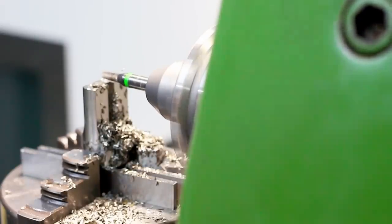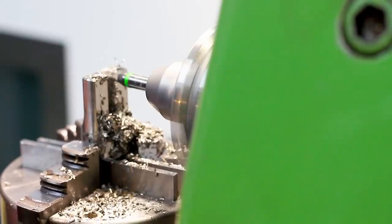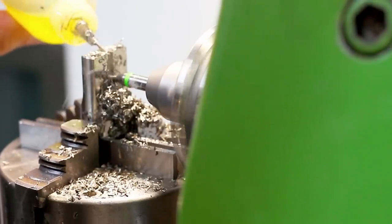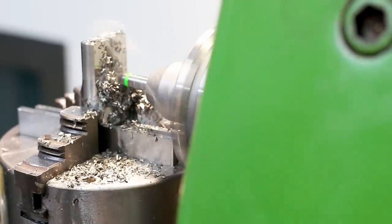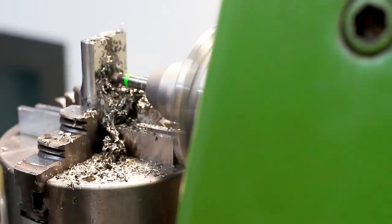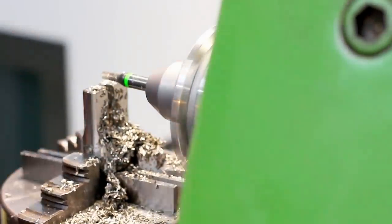I'm doing the center slot in two passes because 1x diameter in stainless with this end mill with the rather bad cooling from the cutting oil is troublesome. I did it on the part before and everything started to get a little bit hot. So taking it in two depth passes, and now I can step over sideways